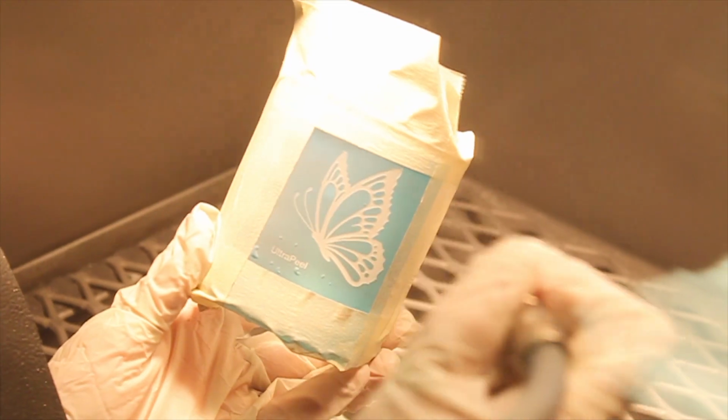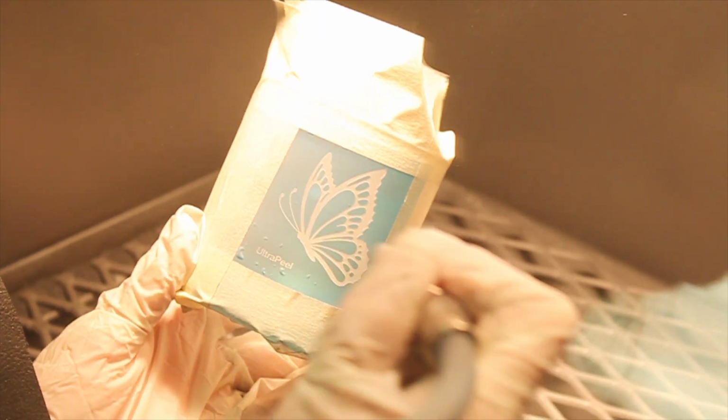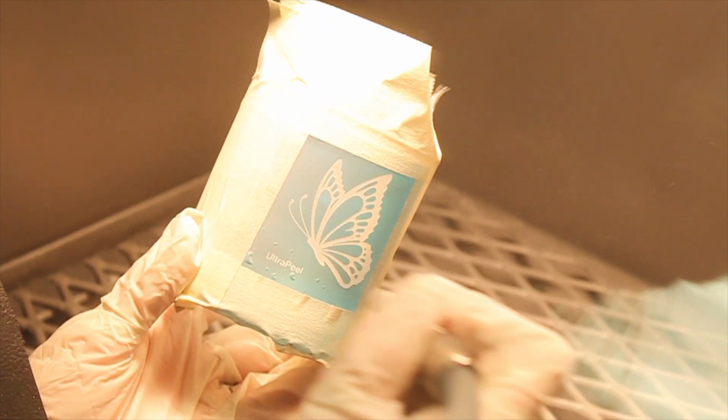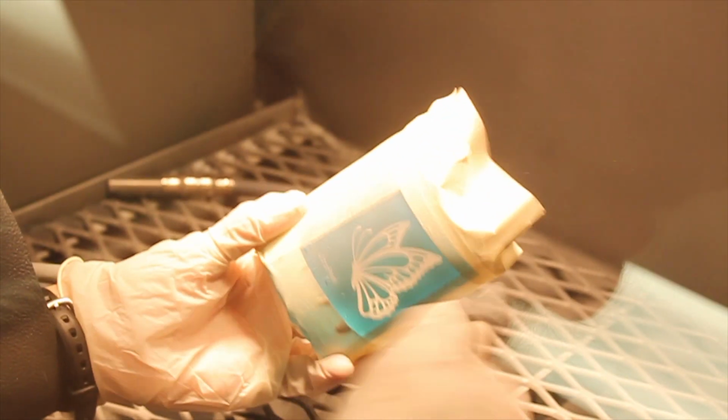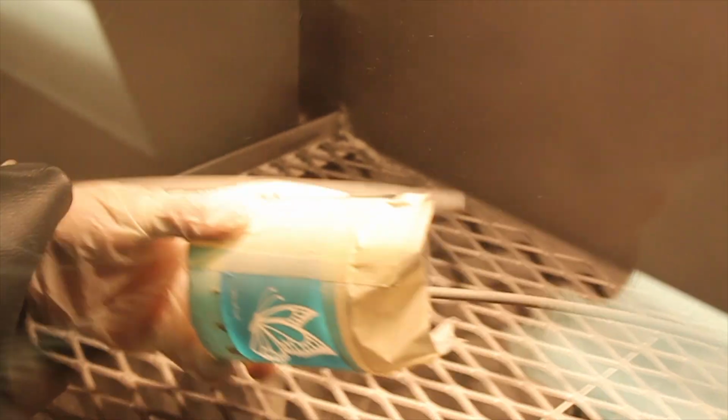The longer you carve, the deeper the etch will be. Thicker mask material will allow for deeper sand carving. When you have completed sandblasting your substrate, you can use your air blow-off gun to remove grit particles from the substrate.